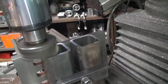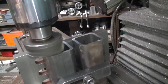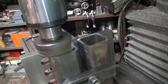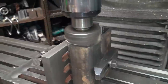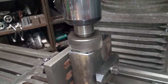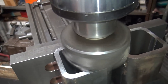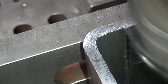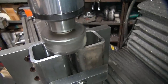None of this is really necessary because if it doesn't rub, I'm fine. I'm picky — I like it being nice. No reason not to make it good, just takes a little extra time. Can we see our witness marks? Yeah, a little bit — see the cross-hatch pattern right there in the corner? Going from both directions, that's the witness mark. So that means it's pretty damn flat.